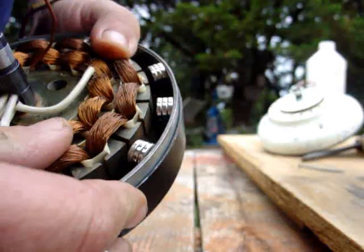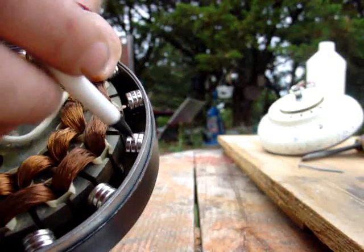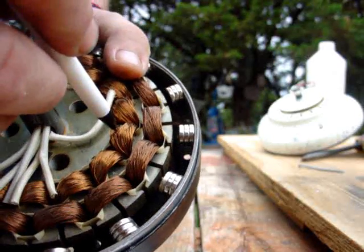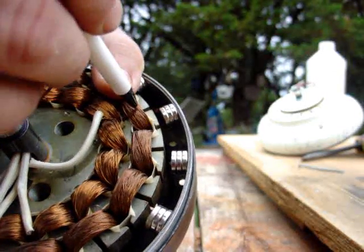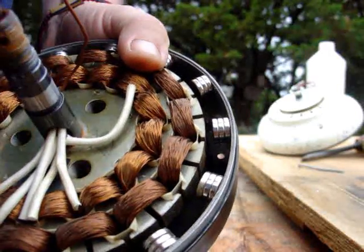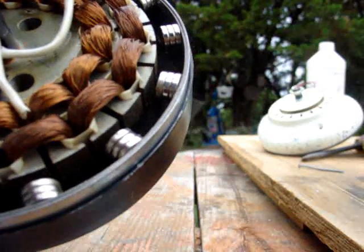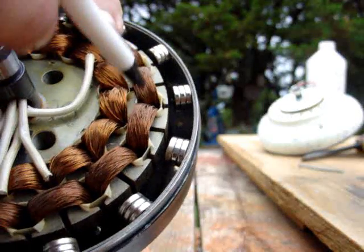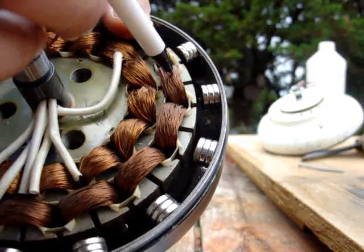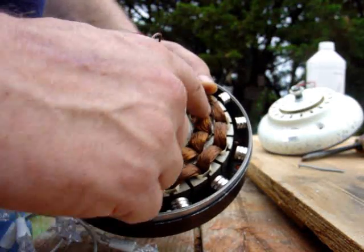I have them set up like this. From here to here, magnetism flows through these coils — these coils here on the outside. So these are firing, then these are firing, then these are firing, then these. This is one whole magnet coil set; this is another coil set. You wind up with these two sets 90 degrees out of phase. 180 degrees out of phase would be from this one to this one, because this one's doing positive while this one's doing negative. While this coil phase is at zero, these ones are at peak.